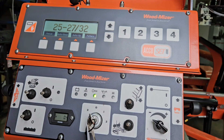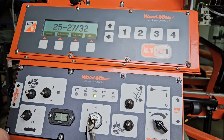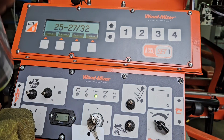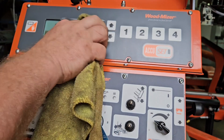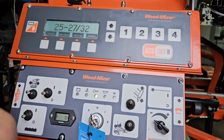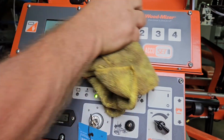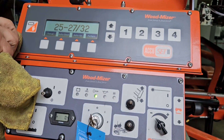First thing I like to do — since we live on Vancouver Island and it rains here ridiculous amounts — inevitably water can get in behind this little membrane. So what I like to use, I used this on my LT70 when I was running it, just a wax of any sort. This one's got fancy ceramic in there. Put it on more specifically into these little tiny areas right along where the membrane meets, just smear it all on there. That helps because as the sun heats and cools this thing it may warp and distort a little bit, you may get a foggy screen. The sun will usually clear it up, but I always put this on all new mills and find it really helps here on Canada's wet coast.